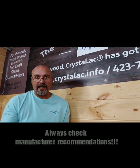So what is dry time? Dry time is that period of time between coats or after your last coat that it's dry to the touch. In most situations, once dry to the touch, you're able to recoat, maybe scuff sand depending on the product or what you're doing. But it's important when using different products to check with the manufacturer and see what they suggest as far as dry time before you're able to do that recoat or that scuff sand or whatever.